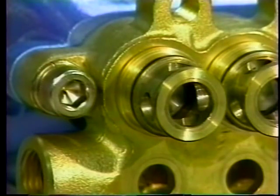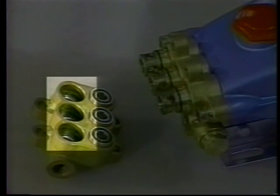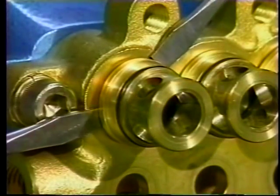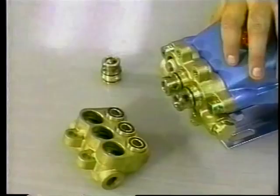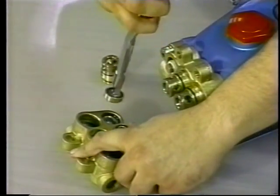The discharge valve assembly is secured in the upper chambers by the discharge valve spacer, while the inlet valve assembly is secured in the lower chambers by the inlet valve adapter. The discharge valve spacers can remain in either the inlet manifold or the discharge manifold. To remove the spacer from the manifold, insert 2 screwdrivers on opposite sides under the machined lip on the outside of the spacer and pry out. To remove the inlet valve adapter, use the reverse pliers to pull out of the manifold.